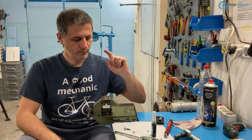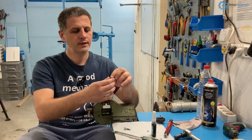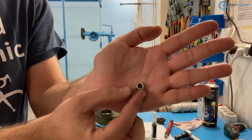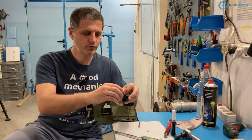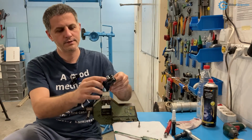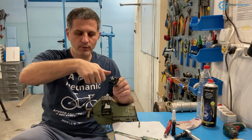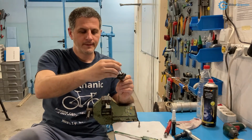Now, my preferred method for preventing bolts from unscrewing is, if I can, to use these plastic nuts that have a plastic insert inside. This is the other end. It's normal, but here they have this plastic insert. Nuts like this cannot easily be unscrewed or screwed on for that matter. So here I can screw it on by hand, and once it has come to the part where there is the plastic sleeve, I can no longer do it easily. I have to use a wrench and continue screwing it on, and the advantage is that they don't get unscrewed. They will keep being difficult to turn until they are completely screwed off. So that works very well.